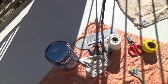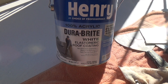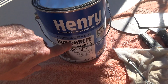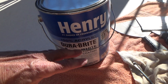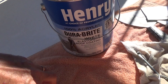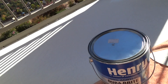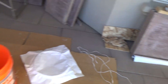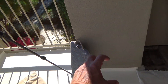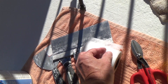I'm letting it dry a little bit longer and I'm still going to use this 100% DuraBright white elastomeric roof coating. This stuff comes out like paste. They have some other stuff — a gallon of heavy mastic that you put on with a putty knife, but I only need this much. I still need to use this in certain areas when I put the Tyvek paper down — I'll go around the edges with this cloth material, cutting it in half and folding up the other half.